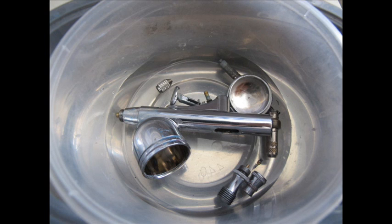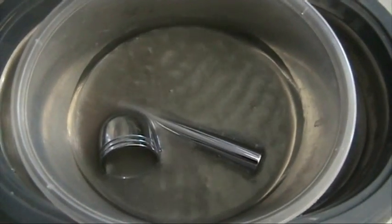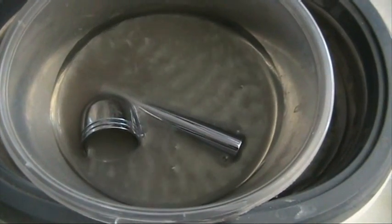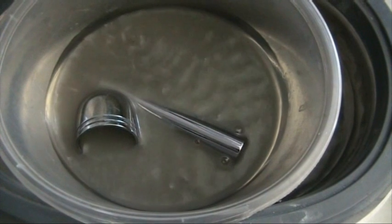Re-greased it with Vaseline. Did all the steps I followed in the first 5 videos. Did test patterns perfectly except for the stuttering or the funny texturing. That was all down to compressor maintenance, which a fair amount of water had to be drained, including about 40 milliliters of water from the tank.